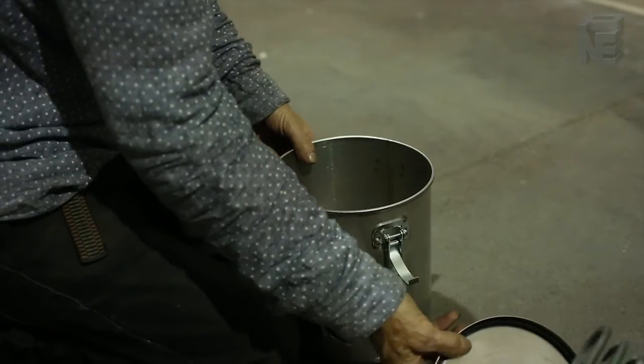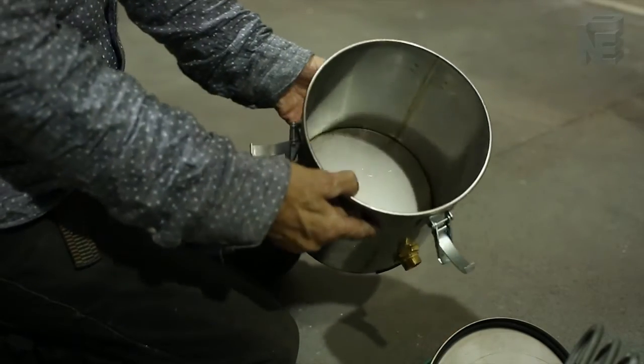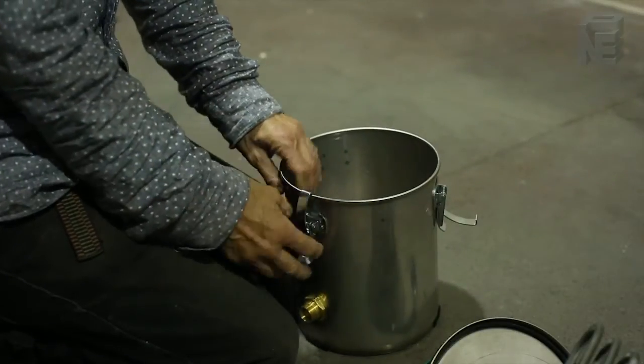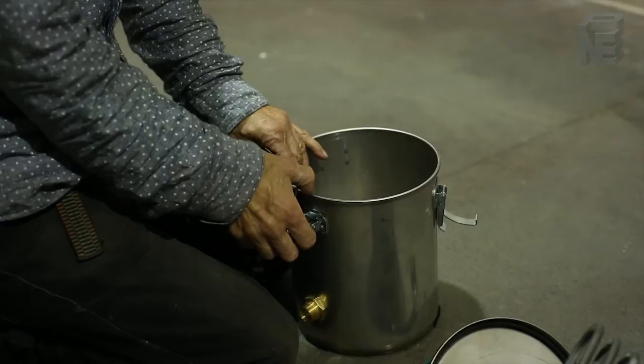It is not necessary to clean the elements. They are self-cleaning. Dump out all the mineral residue and rinse the chamber with water only. Do not use acid or vinegar. If the scale is quite rigid, try to dislodge it with a screwdriver.